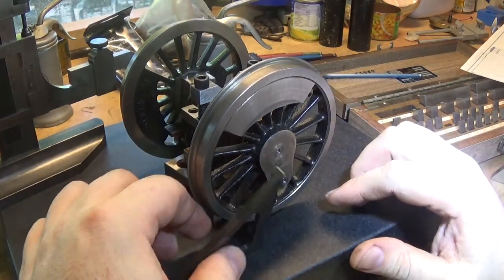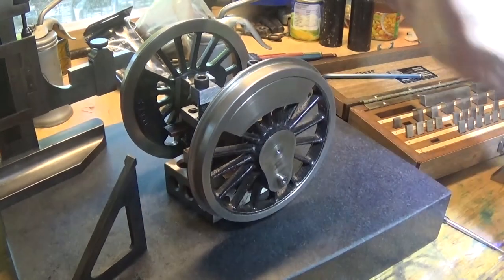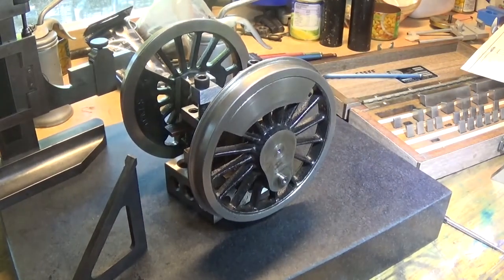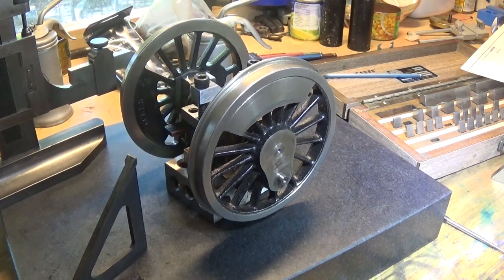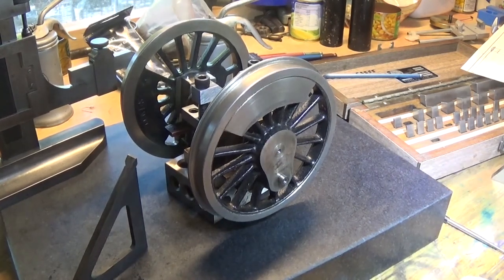So that's how I'm doing it. I've got this one right and I'm going to let it set. Hopefully I've got the right-hand side leading, and I've got the crankpins leading the way they should be too, which is all a little bit scientific and complicated. You consult the drawings and have a bit of a look, and double check and triple check. But so far we've got this right I think, so let's have a bit more of a look when we've got it all back together.